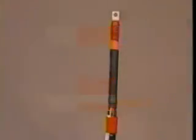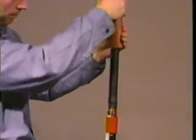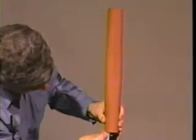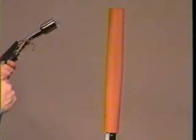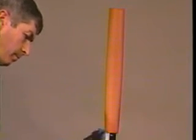Remember, sealant will not prevent water ingress between the strands of the conductor. Now position the red HV tube at the bottom edge of the red sealant on the jacket. If working on a Unishield or wire shield cable, twist the drain wires to make a ground lead at this time. Begin shrinking at the ground end and work toward the lug.